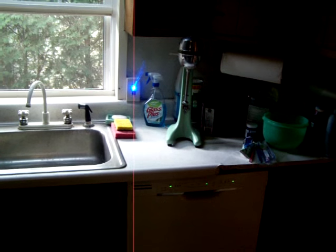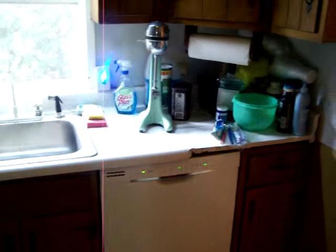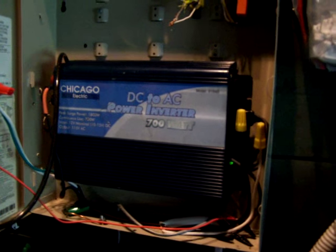This runs off a little 700 watt MSW inverter. There's a little switch underneath it — I turn that on and it turns on the inverter, and you can use the dishwasher or any other 120 volt thing. It's in the stairwell, and that blue light used to be the power meter where I got all my readings from, but I had a lightning strike and that took it out, so it's just a big LED now with a little resistor to lower the current.